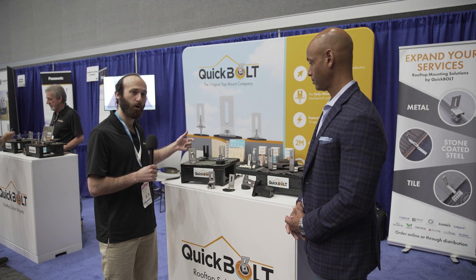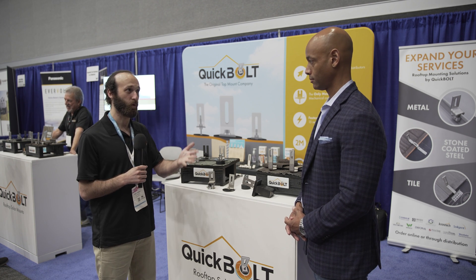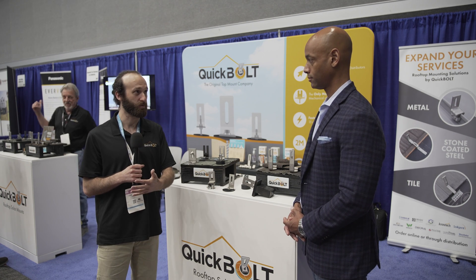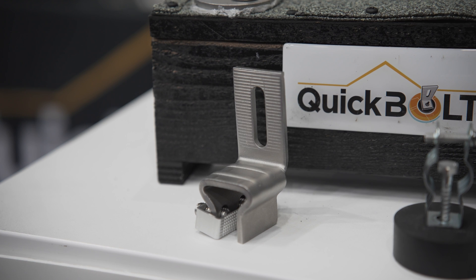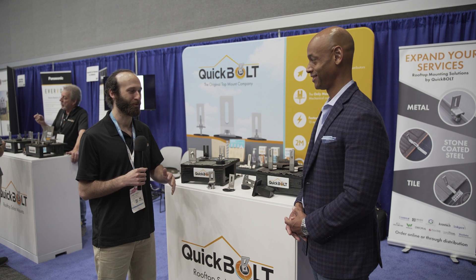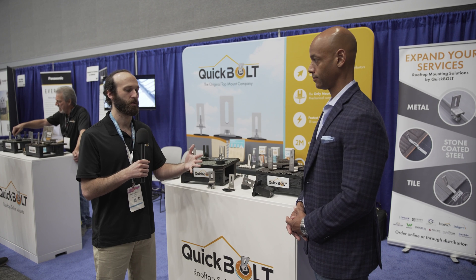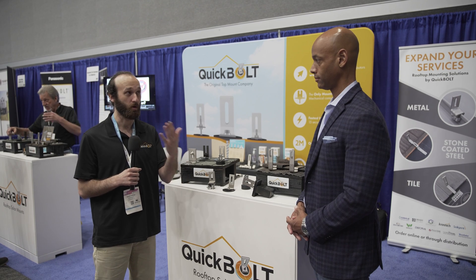Certain things we've done with our Quick Bolts: they rely on what we call bolt seal, where the bolt seals the penetration. As you drive the bolts down, they compress into the micro flashings, and that's where the sealing happens. The main technological difference between our products and competitors' is you can use sealant with our products or you don't have to. We put it through rigorous industry testing standards — ASTM and others — to see how it stands up in rain and high wind zones, so homeowners and building owners can confidently have these installed.